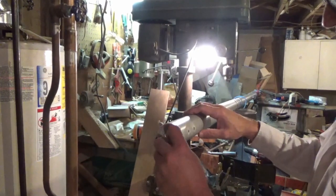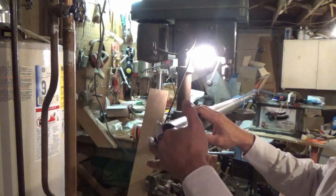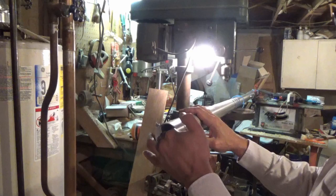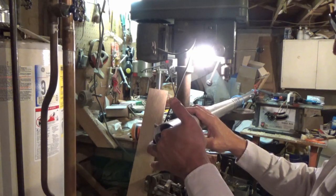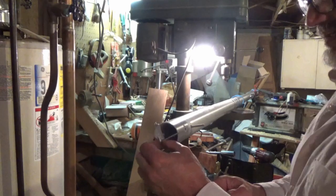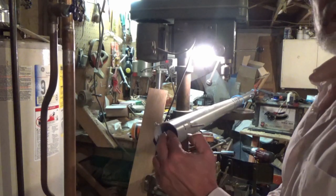Now the bolts for the end eye strap are much easier because you can reach them without passing the thread through. Once again, I'm using 1-inch fender washers under the bolt heads. By the way, when you tighten the nuts down, that will bend the fender washers into shape. You don't have to pre-shape them.